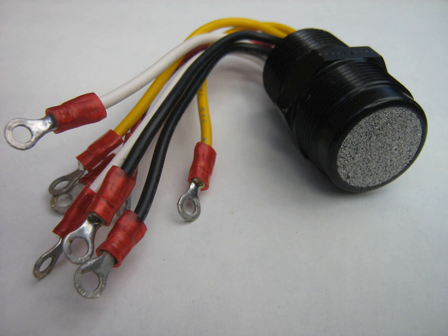Catalyst poisoning: because of the direct contact of the gas with the catalytic surface, it may be deactivated in some circumstances. Sensor drift: decreased sensitivity may occur depending on operating and ambient conditions. Modes of failure, which include poisoning and sinter blockage, become apparent during routine maintenance checking.